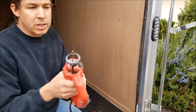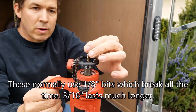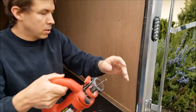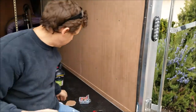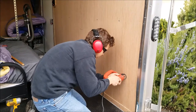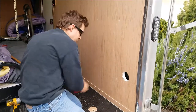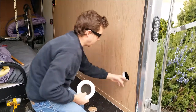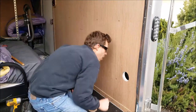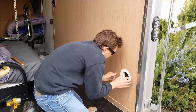Now I know where that hole is inside the cavity. I'm going to use this rotary saw — I use it for cutting out pockets and holes. I've got this oversized bit with a round guided tip, where the blade doesn't extend into the tip. Now I'll be able to put this inside the hole I just drilled, and the guided tip will trace the inside of the circle that's already there. You can see it neatly traced the inside of that hole, running along the inside edge and tracing it around. Now I'll pull the extra chips out of the way.